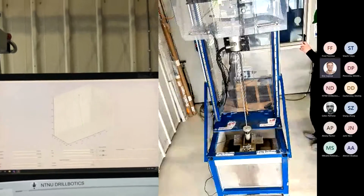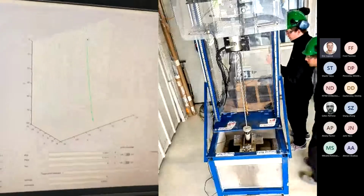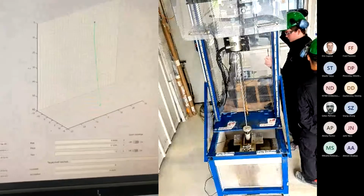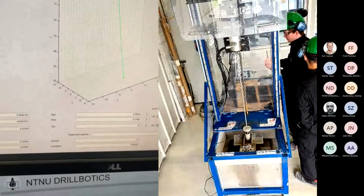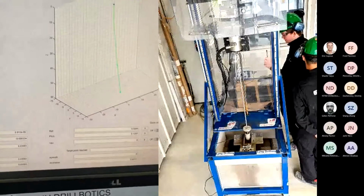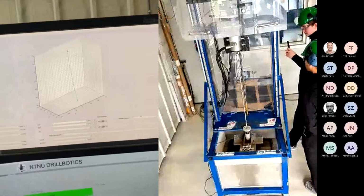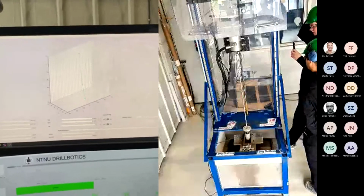And the 0 for the azimuth, since you are not measuring the magnetic field, is it a particular direction compared to the rock? We have assumed that the azimuth is equal to the orientation of the azimuth system. So if we are orienting, for example, 10 degrees, we just put the azimuth equal to 10 degrees. That is, of course, an assumption that will impact the estimation of the drill bit's position, but that's what we ended up with when the magnetic field didn't work.